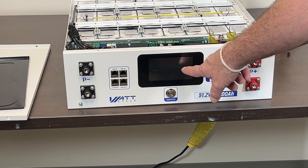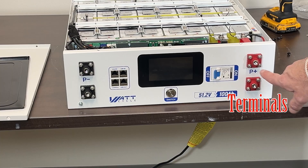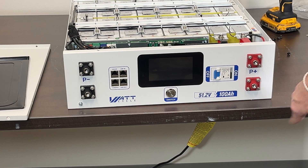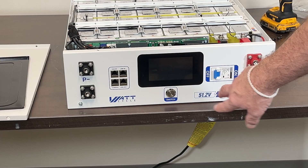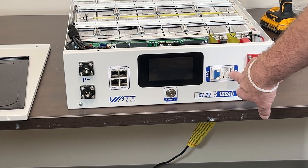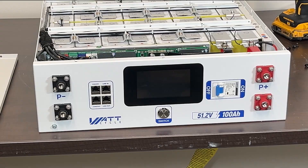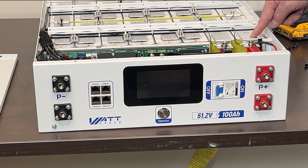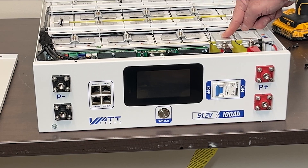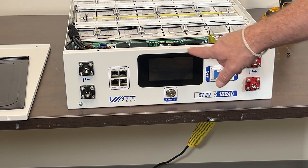Aside from the giant LCD screen, this unit has two connection lugs on the front — the old unit just had a single lug — which makes it easier to interconnect multiple batteries in a large bank. It does have a nice touchscreen display, which I'll show in a minute. Will also mentioned in his video that it has a really nice Chint circuit breaker, which is DC-rated. The bus bars between the battery cells are also a lot thicker than in version one — another thing they fixed based on Will's feedback.